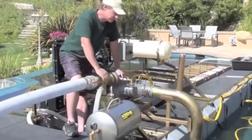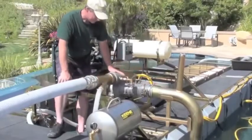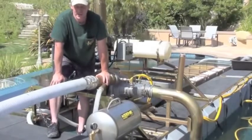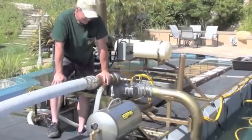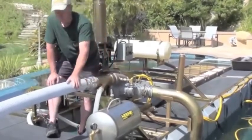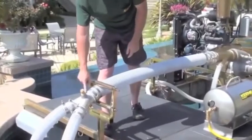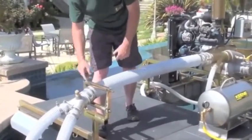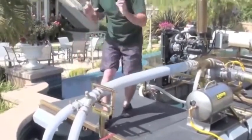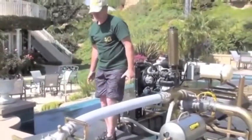So what happens is the pump just pumps clean water. You're pulling in clean water through the pump intake, and the pump is producing somewhere around a thousand gallons a minute at about 40 to 50 PSI. So you're really getting a lot of power out of this. The high pressure water comes through a four-inch pressure hose, into an aluminum Y splitter — this maintains good velocity in the line. You have two three-inch pressure hose assemblies, and the two three-inch pressure hoses go down and tie into the power jet directly below me.